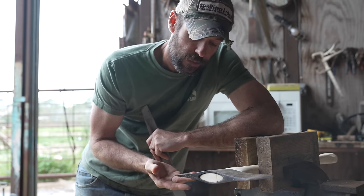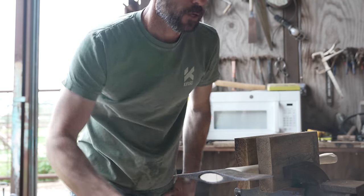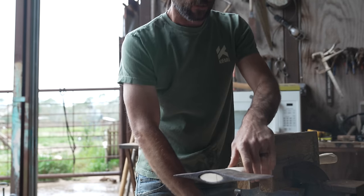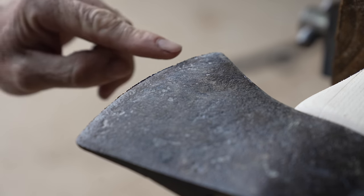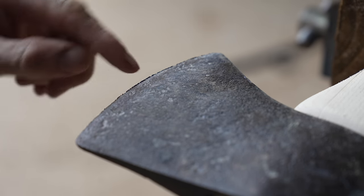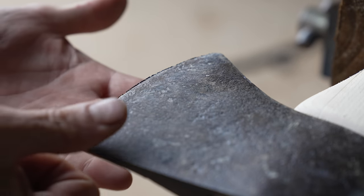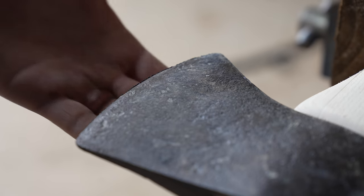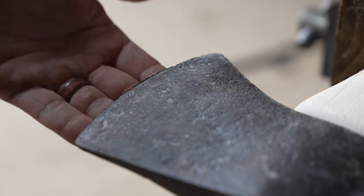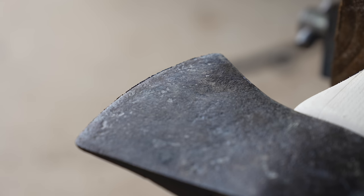On this axe, I can definitely feel that burr all the way on both sides. So I'm going to go ahead and flip this thing over — hopefully you can see that on the camera. Right along here you should be able to see this giant burr right along the edge. That's that very thin edge you're creating when the file — the side that you're filing or honing — meets the other side. So we'll go ahead and take this burr off, clean this edge up, and then we'll be ready to move on to a finer honing stone.